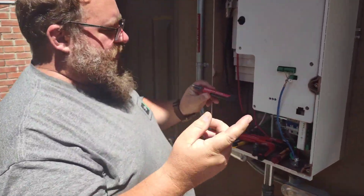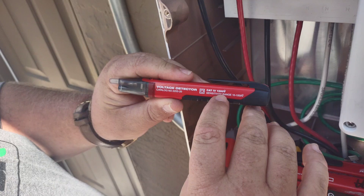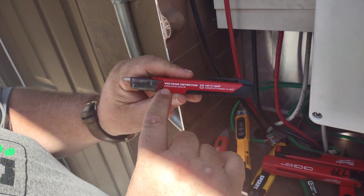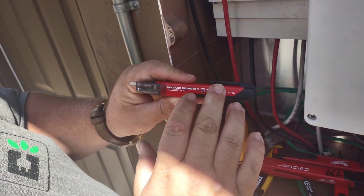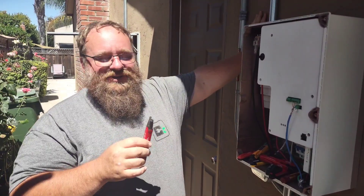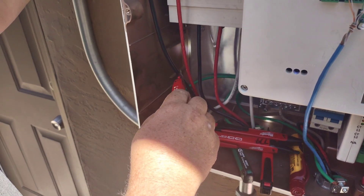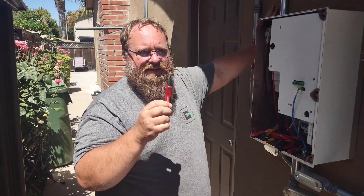Now the last thing to look for is the safety rating. You want a CAT 4, 1,000-volt rating with a sensitivity of 50 to 1,000 volts. This Milwaukee happens to be 10 to 1,000 and double insulated — that's what the two squares indicate. I recommend the Milwaukee catalog number 2203-20 voltage detector. I have all kinds of these and I've had tons over the years, but this is the one I'd go with. Always test it, make sure it's working on a known live source, come over to your dead wire to confirm it doesn't read, then retest on the live source again.